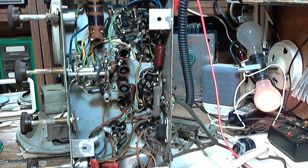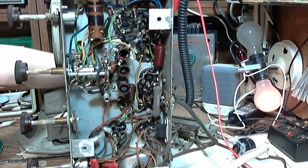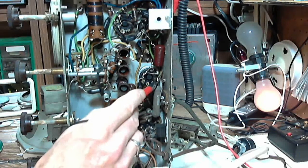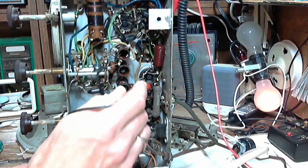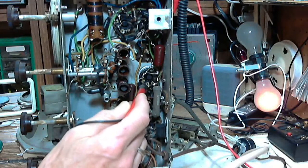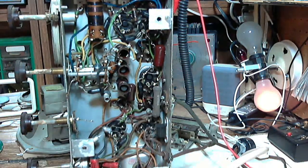Wouldn't expect too much right now. There's no signal coming in. You can't see the meter, but I'll tell you what it says. So I think that's grounded, that signal grid. Ooh, big negative voltage there. It's big in relation to the scale I was on. Hey, wait a minute. This thing is on DC negative. How come it showed it going backwards? Something's not adding up. So I'm getting a DC voltage of... Oh, a big honking DC voltage there. Slightly negative one there.